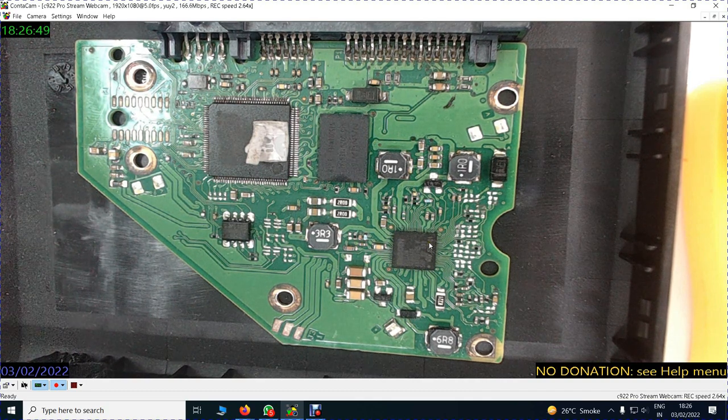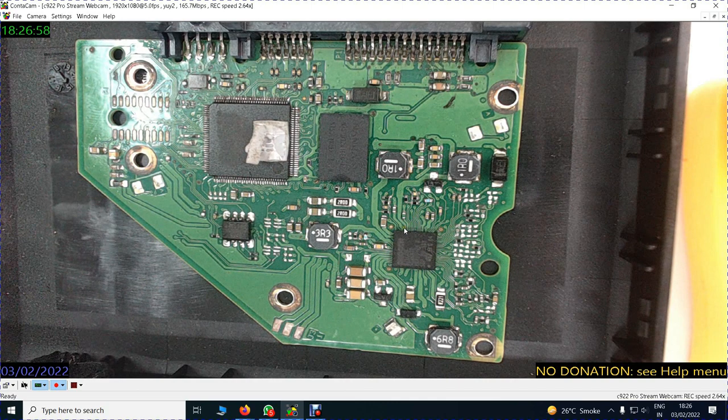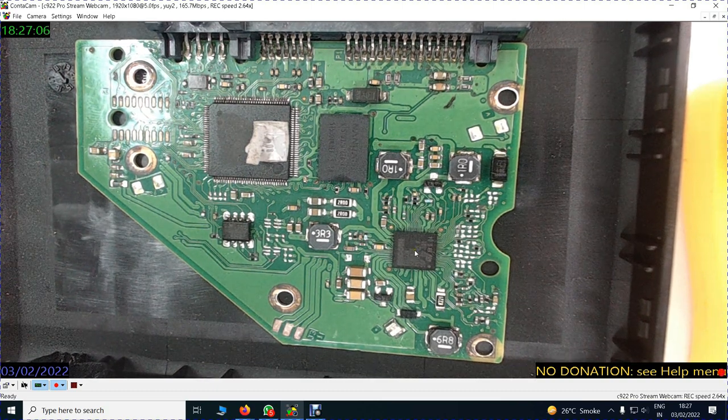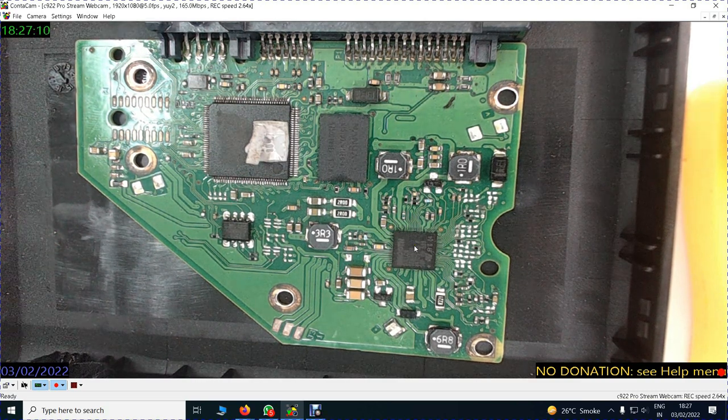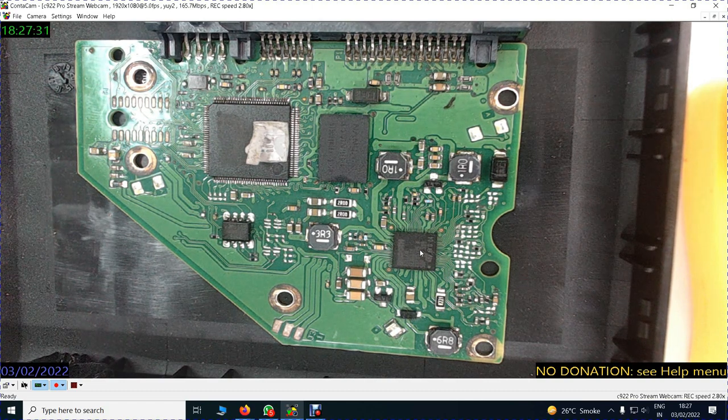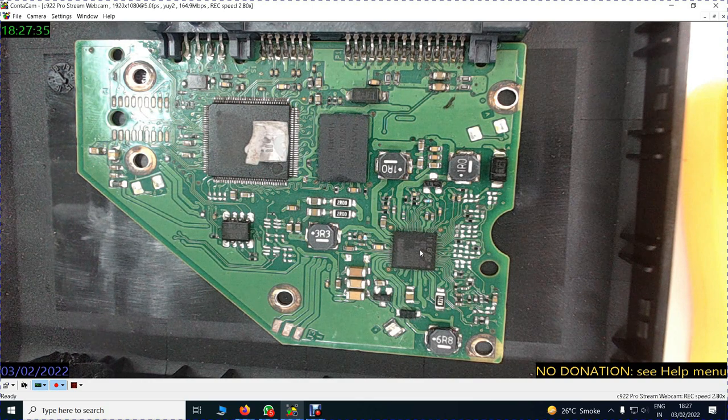Okay. And if it is coming through some of the other rivets, so a certain section of this component which has about, I think, 60 connections. So all these connections are going through this component, and this component is what we call the smooth IC, which plays the role of regulating the motor supply of the hard disk. It regulates the motor, it keeps the speed constant, it also has an inbuilt firmware by which a specific current will go inside the hard disk and make the motor operable and keep it steadily spinning. Also some clutch effects, brake effects, slowing down, all this is done by this chip.